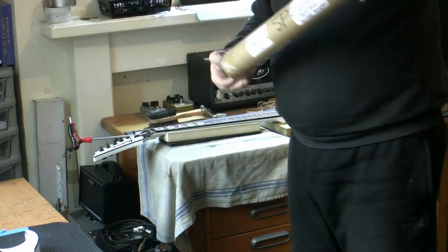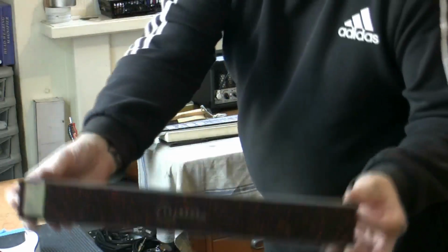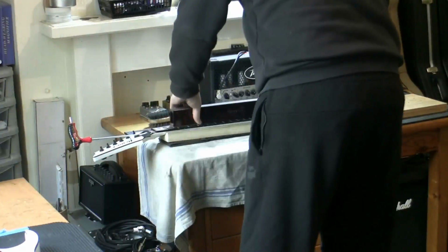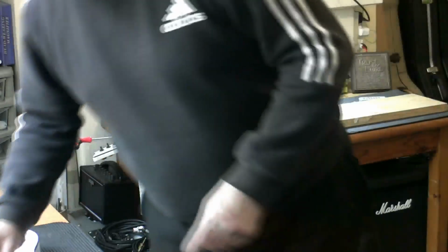file. I'm just going to hit it with the leveling beam, and I'm going straight on with the heavy duty Crimson Guitars leveling beam, precision straight edge, 240 grit on the bottom, 400 grit on the top. I'm going to hit it with a 240 grit. And I'm just going to level those frets. I'm going to need a permanent marker.